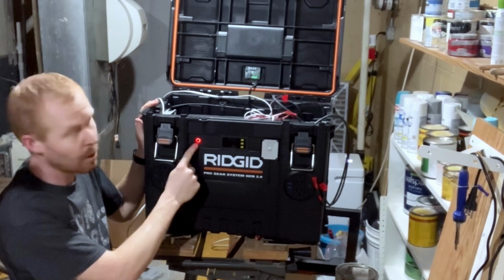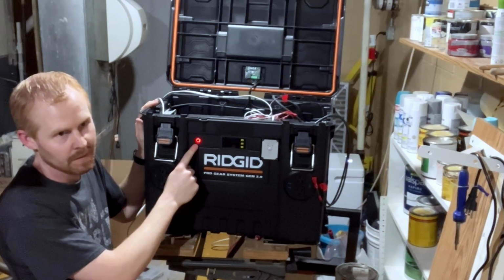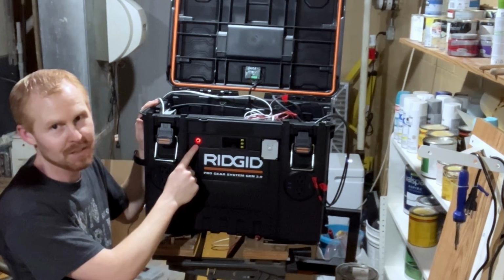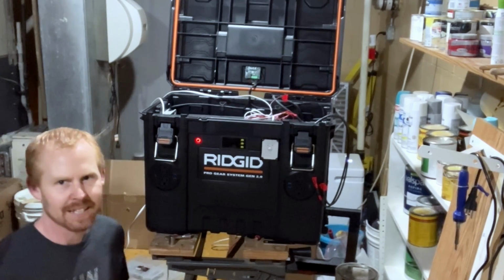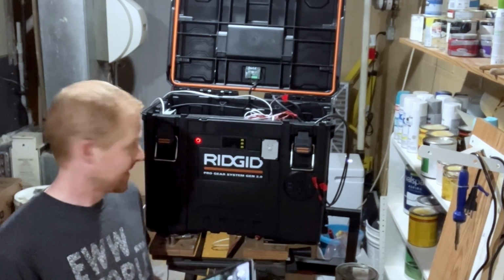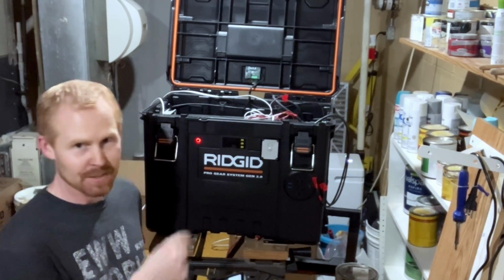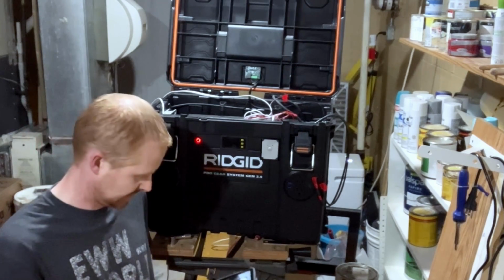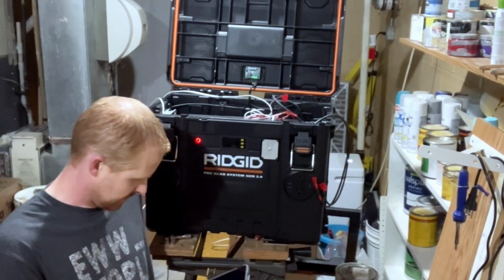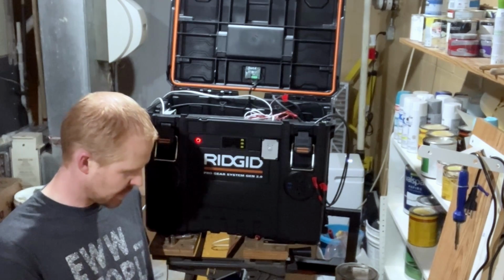Okay, so the BMS turned on. Oh, you know what it is? I might have disabled discharge and charge in the BMS while I was messing with things. Let's hope and pray that that's what I did. Because otherwise, if charge and discharge is turned on in the BMS, that means there's something screwed up with the wiring. Solar, JK BMS, 8S, discharge off, charge off. Whoa.